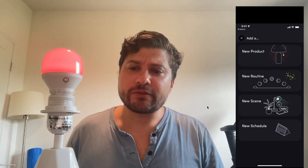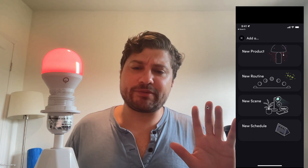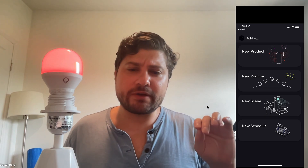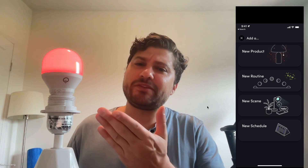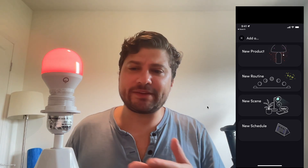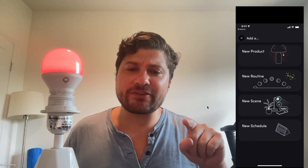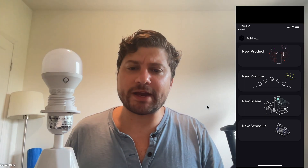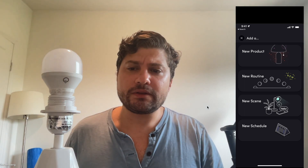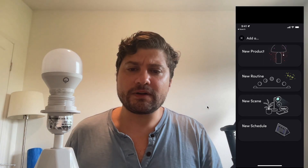When discovering a new device, there's a little trick: you have to turn it on and off five times, about half a second between each on and off. I'll demo that now. This is an example of what the lights look like during wind-down — they turn red like this. To get it into pairing mode, the lights are going to flash all the colors of the rainbow. So here we go: one, two, three, four, five.